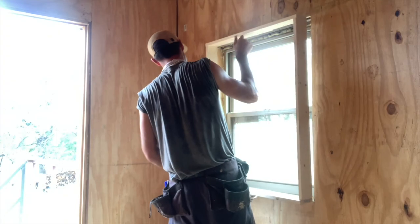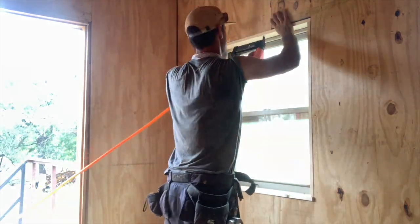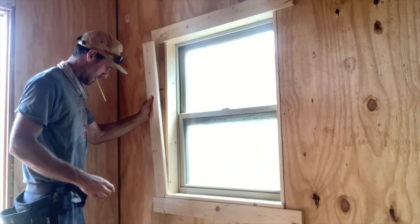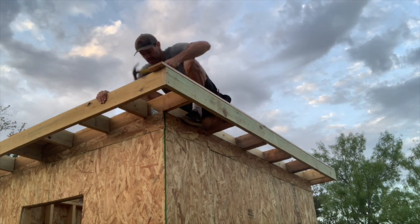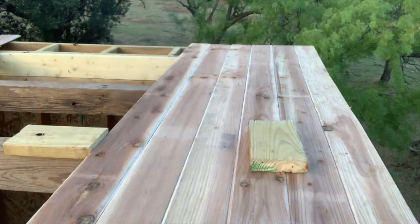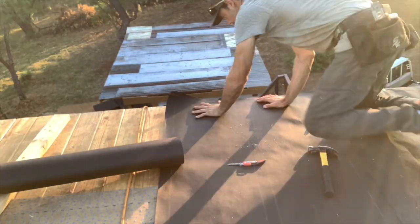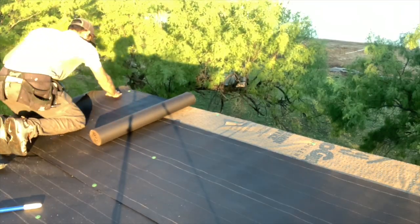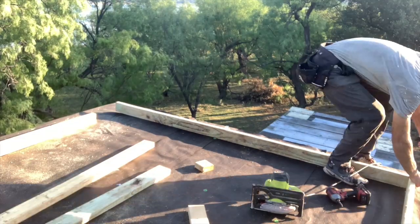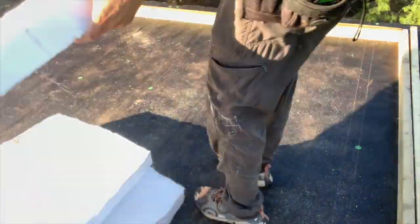When I thought about building this little cabin, there are a hundred little things I just didn't think about — building the interior window frames is one of those things. No big deal, just a lot of small stuff you probably won't think of when you conceptualize the project. In part one, I had hung some salvage roof joists from that same barn teardown and laid cedar siding on top — sort of building the roof inside out to highlight those joists. Once that was done, I laid down some tar paper, hit it with cap fasteners, and then built a frame on top of the roof to put the insulation in. The insulation, no surprise, is more of someone's old dock.